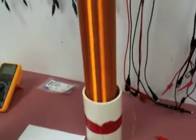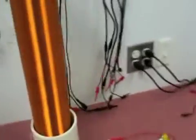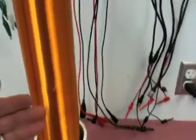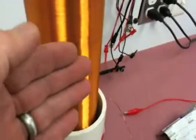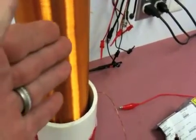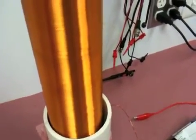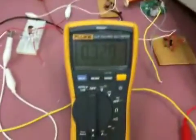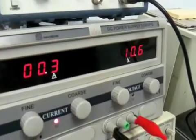We've just swapped the towers out again. The one with the secondary coil is now at 30 gauge and the other one, the 26, is now the second one over here. This one — the force is literally sucking the wire to my hand. Just by having my hand anywhere near it, it burns badly. It's pulling about 329 milliamps at only 10 volts — about 10.6 volts. So that's pretty impressive.